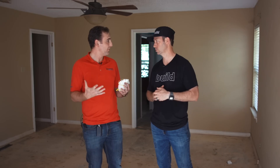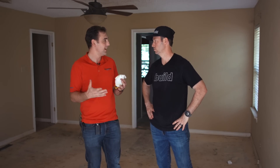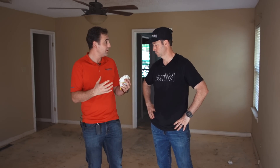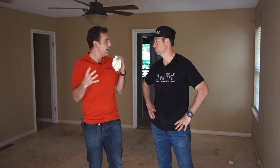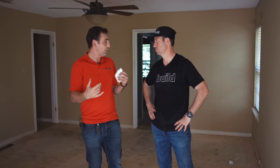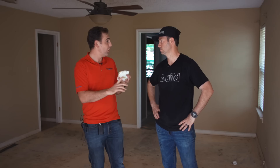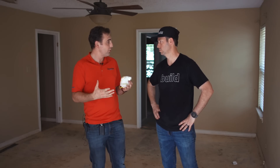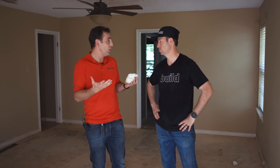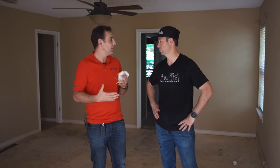What Sean does is called a home performance assessment — it's not just an energy audit looking at how much energy you're saving or wasting. Building science is a system of interrelated systems, so he wants to look at as many of those as possible: blower door, visual inspection, duct leakage testing, IR scans. You can pay as little as $200 for someone to do a blower door, or you may want a more extensive audit.